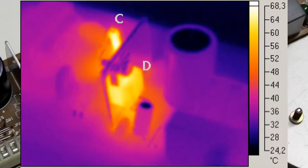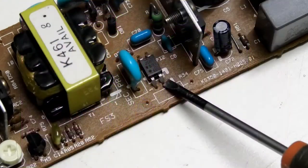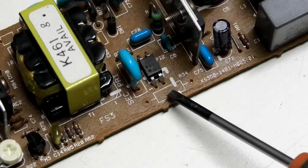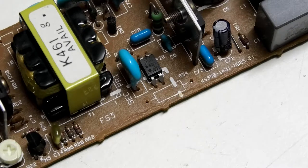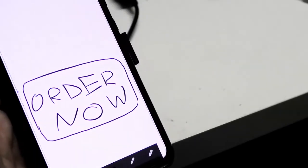They said it could be the TOP202YAI, rolls off the tongue, and that does get hot, and it's really close to the source of the buzzing. I think there are modern replacements, but we'll look into that if this capacitor idea doesn't work out. Speaking of which, I've got to order one. Good thing RS Components have very fast postage.